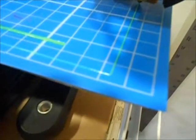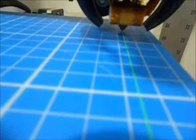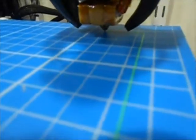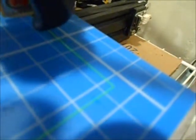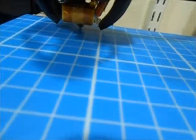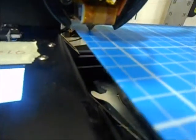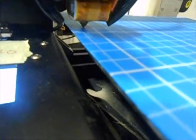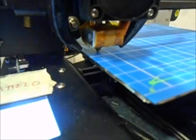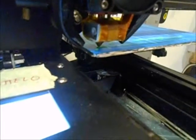It's important to note the corners: if you see a nice sharp corner when printing a box, that means it has pretty good adhesion. If it's a rounded corner, it's not sticking very well. We'll follow along the perimeter to the back corner and you'll see it is a very sharp corner. Watch the entire perimeter to make sure it doesn't change from start to finish — same thickness, same transparency, all the same. Once you get that nailed down, you're close to getting your bed level sorted out.